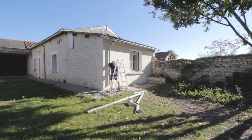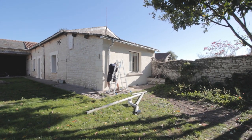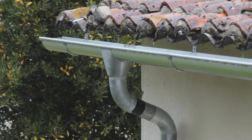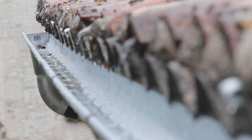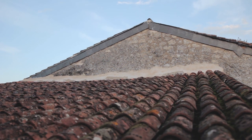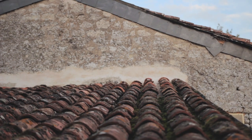The first one proved easy, as it didn't require a soak-away — just new guttering, some brackets (or in French, crochet), and a downspout. The runoff was good, and now we no longer had rainwater splashing up against our bedroom. The room now feels a lot less damp. This is also because I rendered between the house and the roof extension, where the render had cracked, which was allowing water to run between the walls.